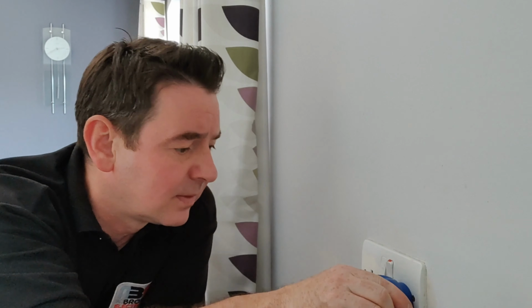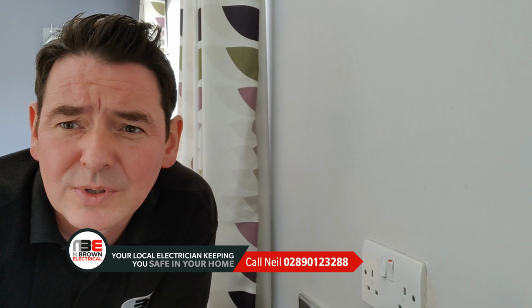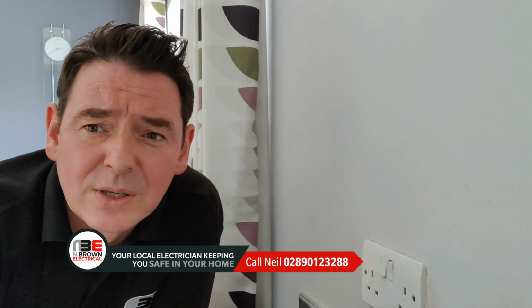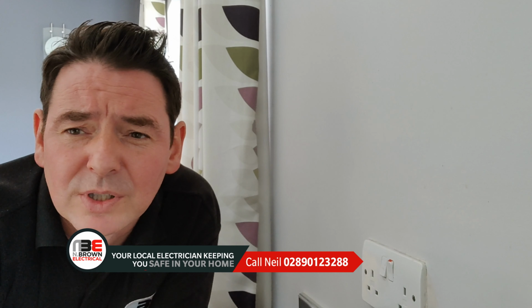So this is the socket we want to change today, and this is the new socket we're going to install. And obviously there's power on the circuit, so we need to isolate that. Now, if you know the particular circuit breaker for this socket, then all well and good, but I would suggest if you're doing it in your own home, that you turn the power off to the house just to make sure, unless you've got some sort of test equipment to prove that the electricity is off after you do that. So I'll take you over to the board now and show you how we turn the power off to the circuit, and then we'll be able to install the socket.